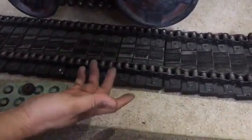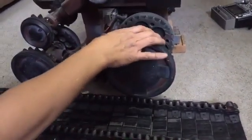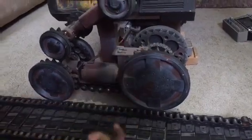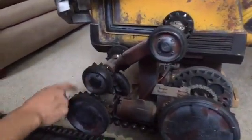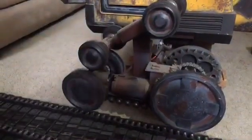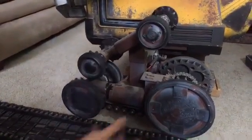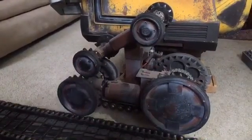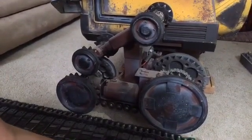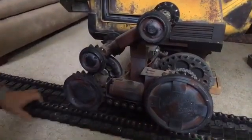When I came up with this all-metal drive system, what I envisioned was replacing the smooth wheels with heavy number 60 chain and number 60 gears going all the way around. Another critical thing you've got to do is make sure everything is as friction-free as possible, because a drive train like this will create so much friction that your motor is going to struggle like crazy to push your robot. That's why track drives are so bad versus wheeled robots.